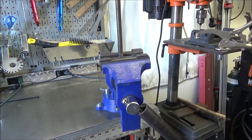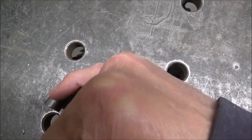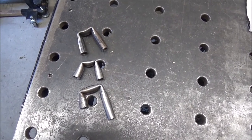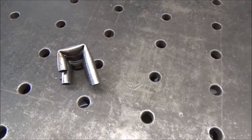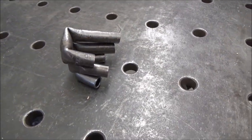I'm going to start off with the fingers first because those are the easiest. I'm using one-half by one-sixteenth wall tubing. Just bend it to whatever angle you want your fingers to be. There are the three angles I chose, just set on top of each other in the approximate area where I want them to sit.